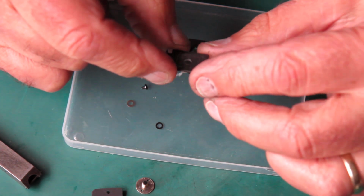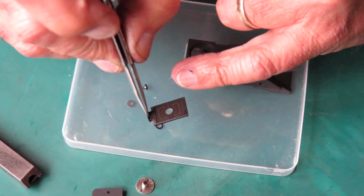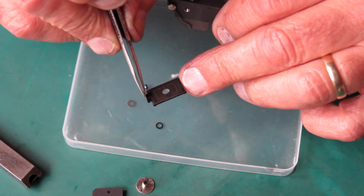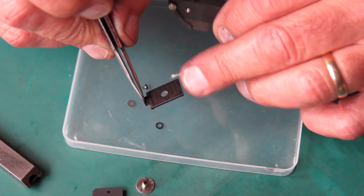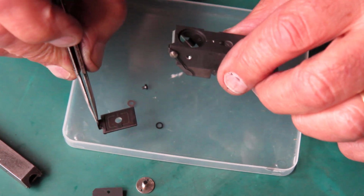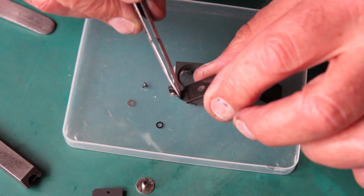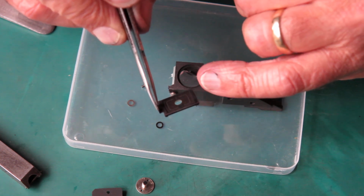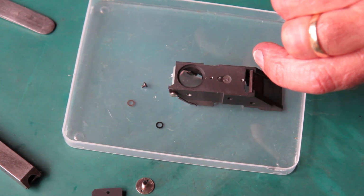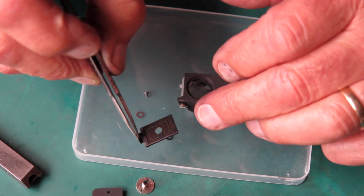Now this you most certainly do not put through the ultrasonic cleaner if you're cleaning it that way. This is like a piece of film. Now I know if this gets wet, if it's cleaned in an inappropriate way, that gelatin layer breaks up basically and you end up losing your frame lines. What can happen is that you end up with fractures in the gelatin, and then you end up with clear spots. Those clear spots will all look like bright lines in your finder. So if you've got lots and lots of extra bright lines, it's because that gelatin layer is breaking up.